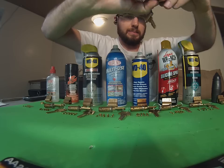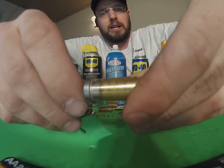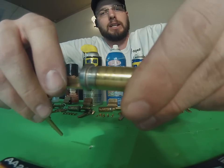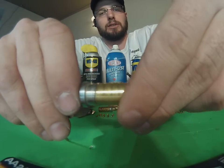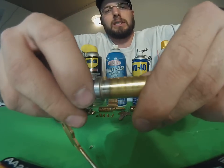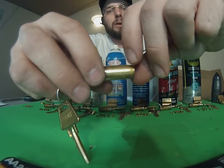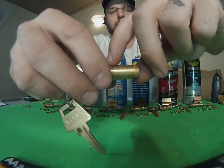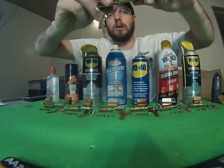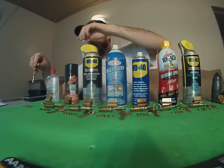When I pull this key out, you'll see how the pins move. Moving smoothly like that and not getting stuck in any one position is exactly what we want to see. The dry Teflon right here is a perfect example — everything moves nice and easy. We're also looking for burning, which is a sign of the lubricant deteriorating and breaking down. There's not very much of that here, if any at all.